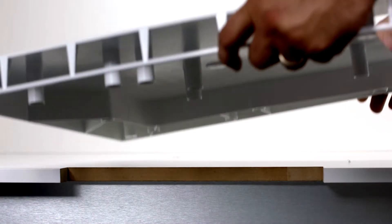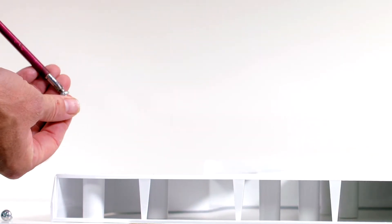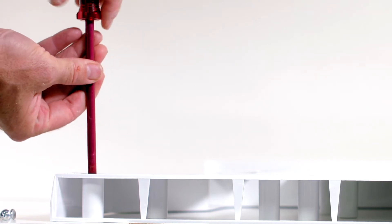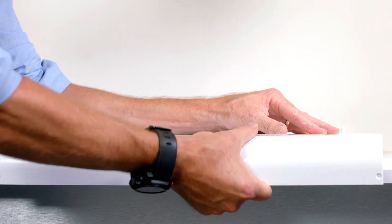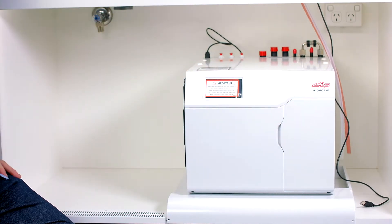Mark and make the cutouts. Fit and secure the cold air inlet grill to the cupboard. Then line up the vent tray with the back of your hot air outlet cutout and secure with the screws provided. Fit the outlet duct to the front of the vent tray and secure the duct with the screws provided. The command center will then slide easily onto the vent tray.